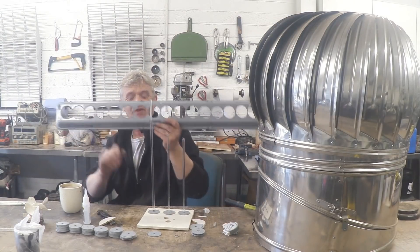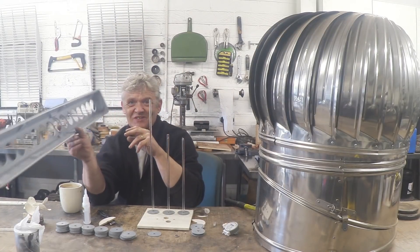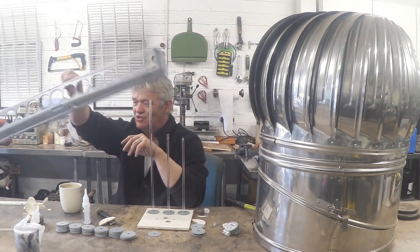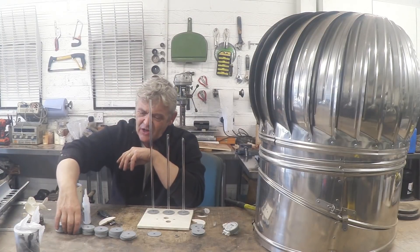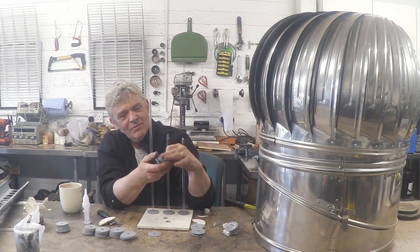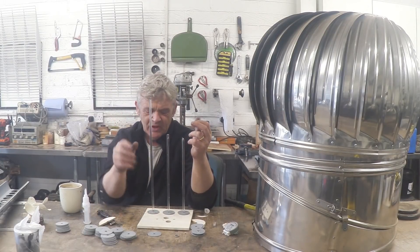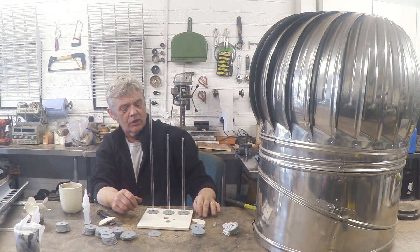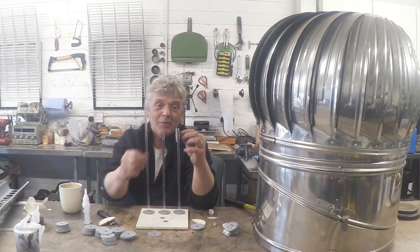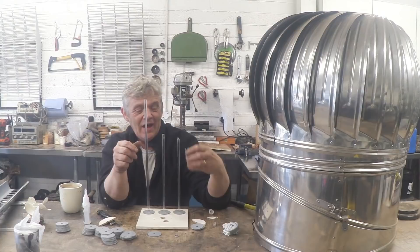In order to make a coreless coil I obviously have to make a bobbin, and that requires a lot of plastic. I came across these — half of an ABS light fitting, impact-resistant ABS. I've gone down the back with a flat-end cutter and drilled out a lot of discs using a hole cutter, then cleaned them up and made sure the center hole was 8 millimeters. Those are going to be the basics of my bobbin. I have a jig in front of me to help form the bobbins, and there's a completed bobbin — I need to make a whole load of those.